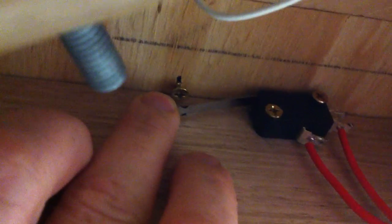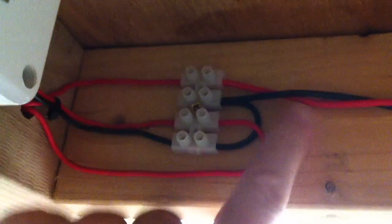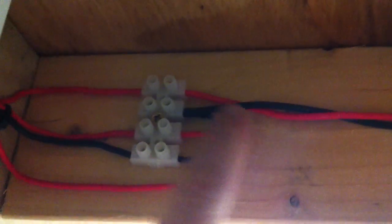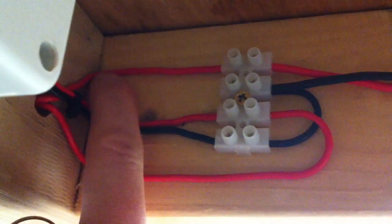This is the toggle switch. Positive power comes in off the wiring block, and if you notice up here there's a little drywall screw in the top — basically that's just screwed down and allows the little tab switch to come down. This wiring block then runs through the layout underneath and back through into this terminal block. This side here is the main power feed coming in into the top wiring block, then power comes out this side and runs through to the toggle switch.